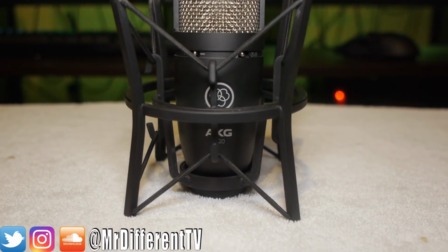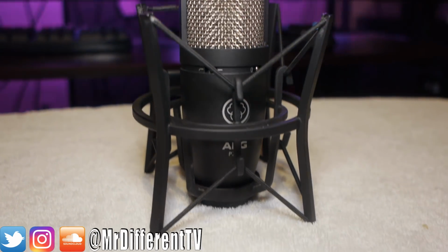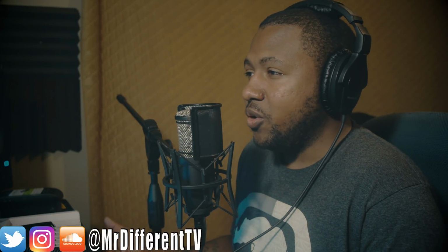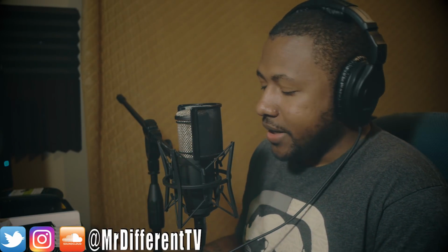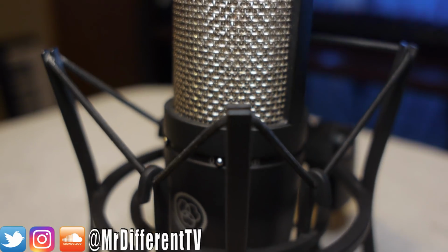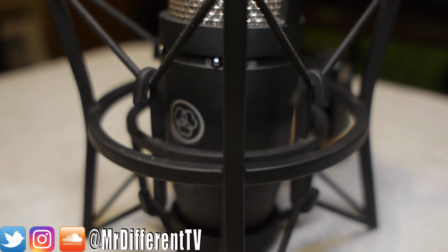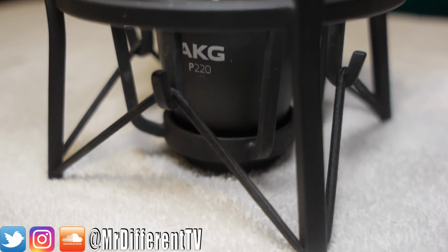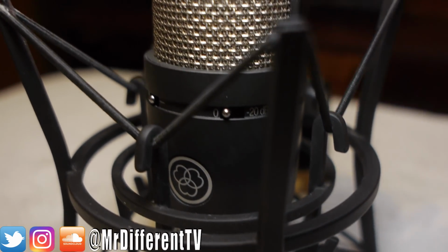As you see, it's a simple microphone. It has one polar pattern, which is cardioid, which all these microphones are going to be, more vocal-oriented microphones. It has a 20 dB pad on it, and it has a low roll-off, which I think is about 80 hertz. Right now, you're hearing it going straight into my Apollo Twin Thunderbolt. No effects, no processing. This is the raw sound of this microphone.